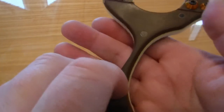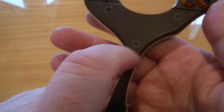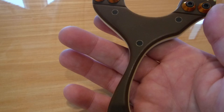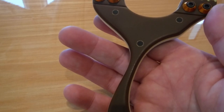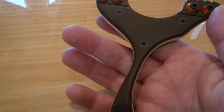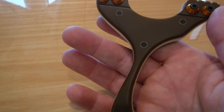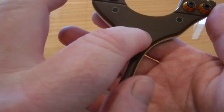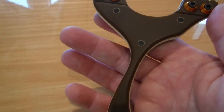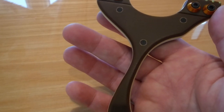Now there's been a little bit of fracturing around the edges of the pins where I've drilled. But if I'm honest, the only thing I've found in all the time I've been building that you can do to avoid that is to use a brand new fine drill bit — the sharper the better. I used a brand new fine drill bit on this catapult and we still got these markings around the pins.